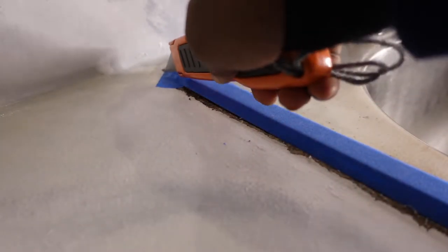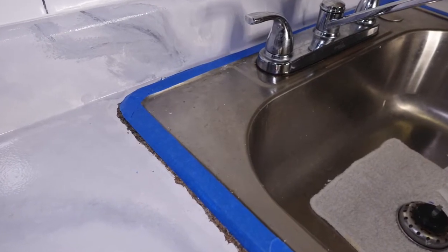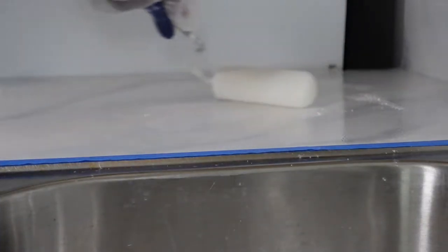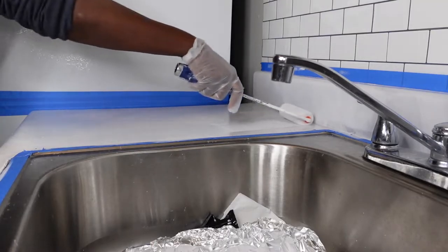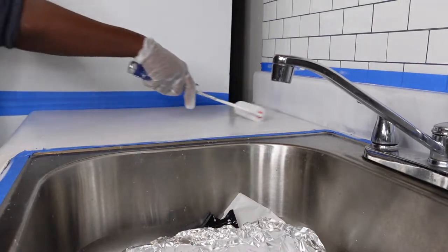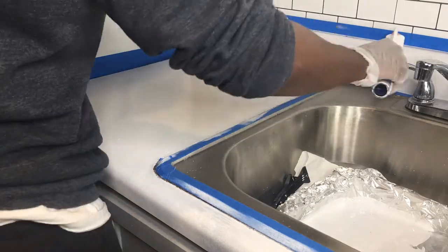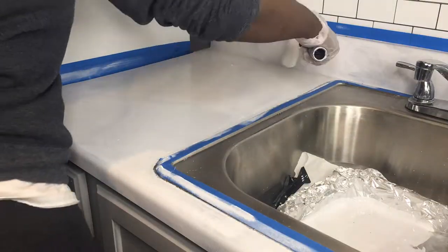Next, I will be going around with some painter's tape and cutting off any square edges. Then I am going over the old faux marble with some of the epoxy paint on my foam roller. I am doing a couple of very thin layers because I do want the previous gray from the old veining to kind of show through to give me some dimension.